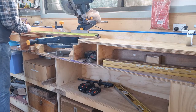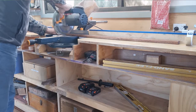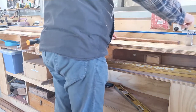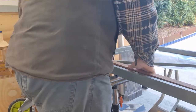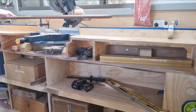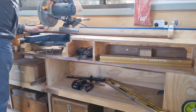We'll use our mitre saw for this — a mighty mitre saw. 995mm is the length. Cut one to length, set the stop, just make sure it works. It fits in the way it should, and yes it does. Now we cut another 9 pieces, and then all the timber slats together.